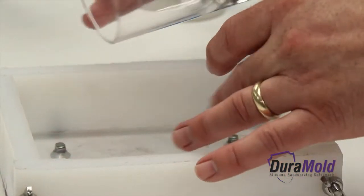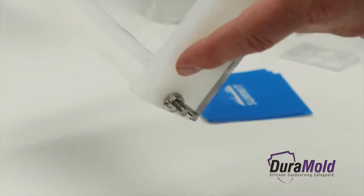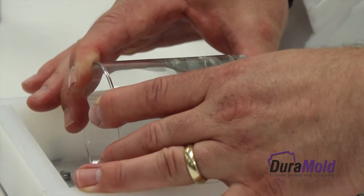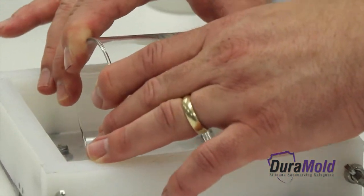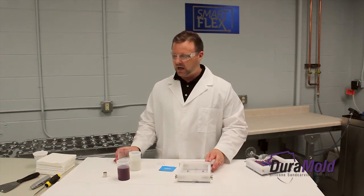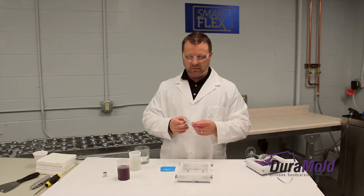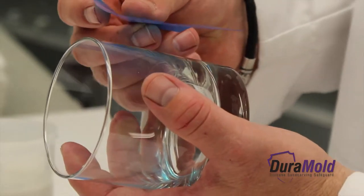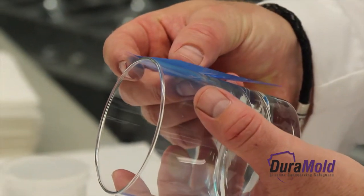You could use two spacers — I'm using three. They're evenly spaced so when I press down with the low ball glass, they'll stop at the spacers evenly and the glass won't be rocking back and forth. Now that the spacers are placed in the mold box, I'm going to take my glass and apply the mask. Just like before, I'm going to find the location of the mask where I want the sandblast zone to be.